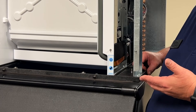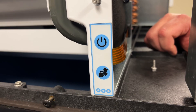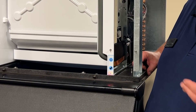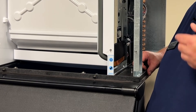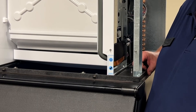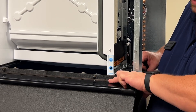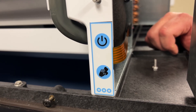This is error code number six — a maximum length purge cycle. Typically you only see this during a cleaning mode. However, there are times you can see it during a freeze, or should the machine have been shut off and the water pump fails and it tries to purge. If the machine has been off for more than 24 hours, it will purge for the first cycle. You are going to see a heartbeat flashing red and yellow light, two per second.